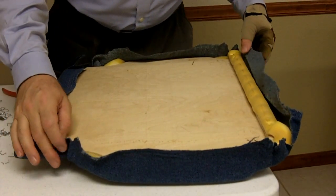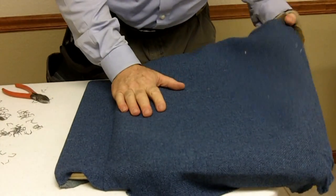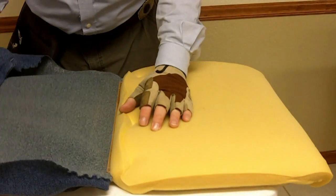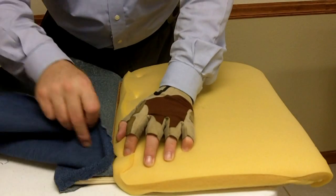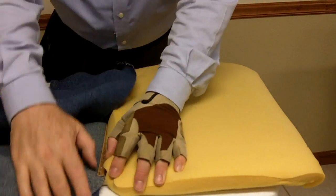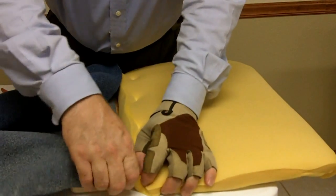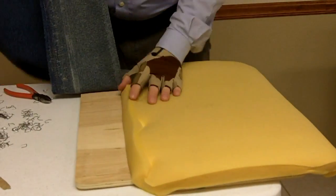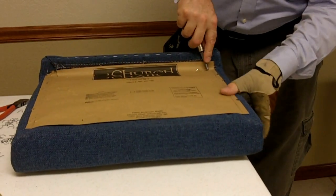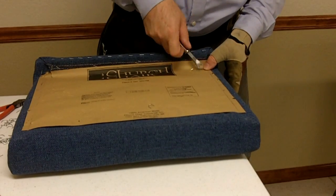So that's the end of the back — we're about ready to turn it over. There are some fancy pleats at the top that we'll show you when we get to upholstering. This is actually one piece of fabric, and some of the cardboard holds one layer back so it shows up as a separate piece. So now the back is stripped. The cardboard on the bottom has some law tag information required on new furniture in some states, as well as advertising for the chair manufacturer.